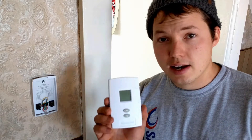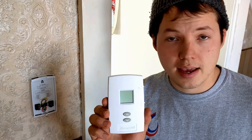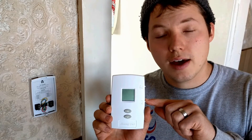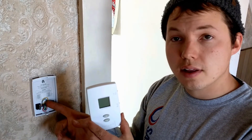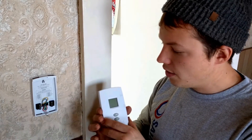There's really no benefit to using batteries in your thermostat either. If you have batteries in your thermostat, it'll look like it's working even if for some reason the power tripped on your furnace and there was something wrong with your equipment — your thermostat would still show that the heat is on or working when it actually would not be. If you have it hooked up on the common wire, and the furnace dies or shuts down or power gets disconnected, the display on your thermostat will go blank, and so you'll know maybe a little faster if you've got an issue.